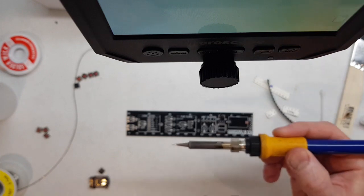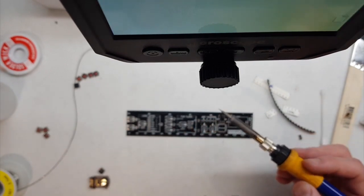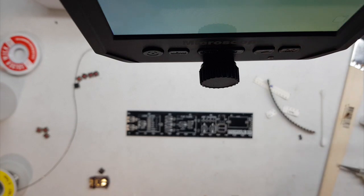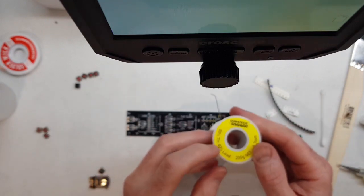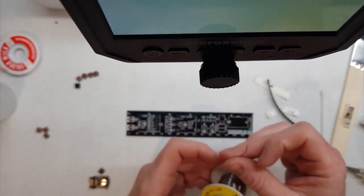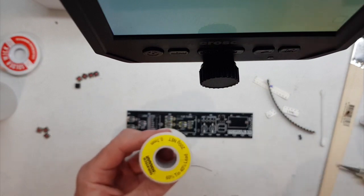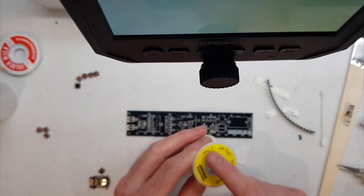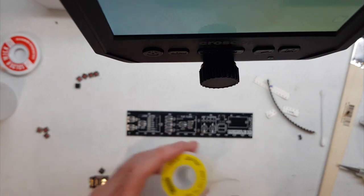The stuff we're going to need is a soldering iron — this one's just a cheap one with a pointy tip. I like to use chisel tips generally, but I'll work with what people might have. We're going to need some solder. I use leaded solder, normally 60% tin, 40% lead — it's easier to use than lead-free solder, flows nicer, and you can use a lower temperature. I've got 0.7mm; if you can get something thinner for this surface mount stuff, that'd be better.